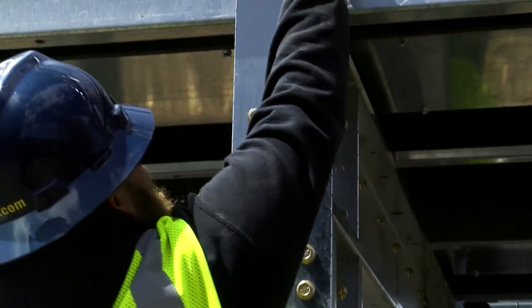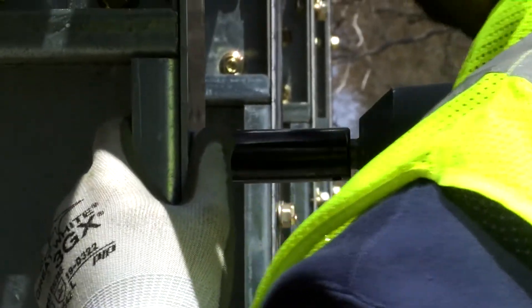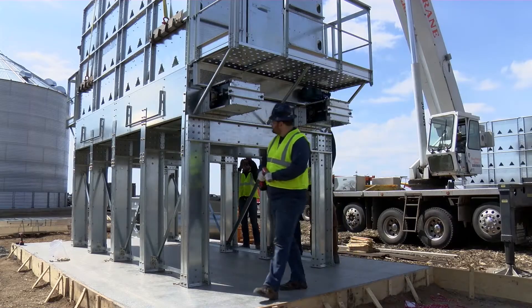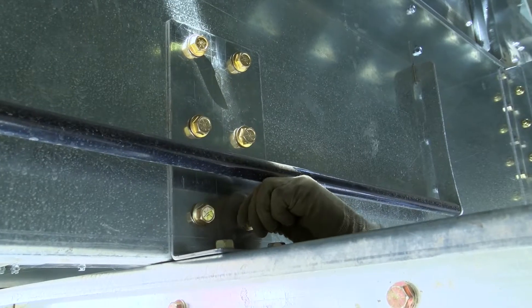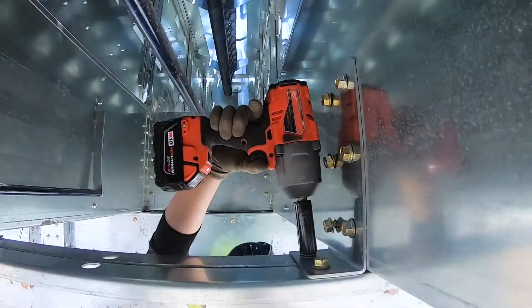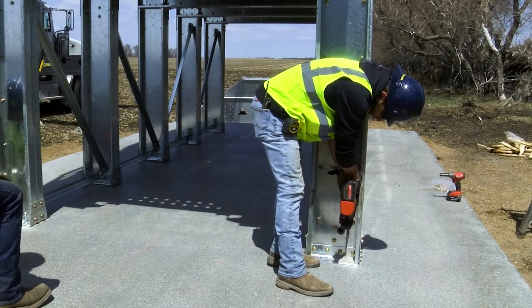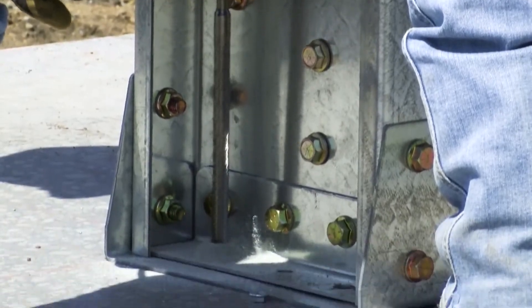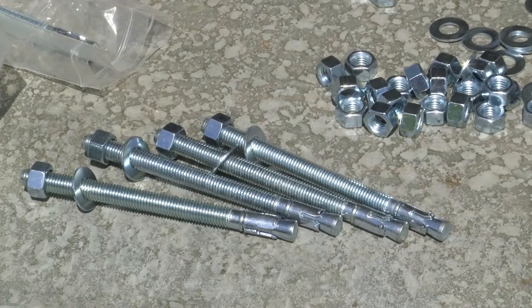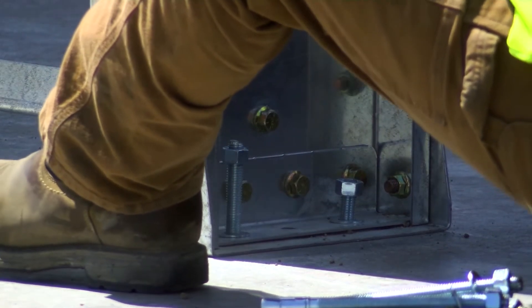Tighten the straps to the tub and the legs, then tighten the angle bracing and the horizontal bracing. Slowly lower the completed assembly back into position on the concrete. Install the tub angle brackets on the inner panels of the tub and to the legs as shown. Reinstall the hardware removed from the platform kickers earlier. Using a 5/8 inch anchor bit on a hammer drill, drill in 4 anchors per leg. Make sure the legs are level vertically, and if there are gaps between the feet and the concrete, use the provided shims to level the legs before anchoring.